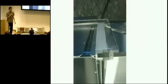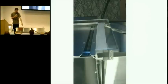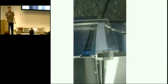So yeah, I'll say a little bit about this. We're calling the saddle the thing that moves the book back and forth. It has clamps on it to kind of hold the book in place. And another purpose of the saddle is it has these white strips on it, which are used for calibrating the sensors. So when it's in the home position, those strips cover up the sensors. When you first start scanning, they figure out what color is white, and they calibrate to that.